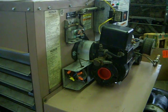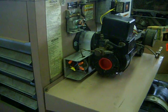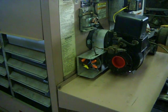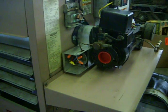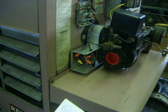Another thing, do not mount your furnace in the center driveway of a shop. Sometimes people back their semi-trailers into the shop, and they back right into the furnace on the ceiling, running, and knock it smack off the ceiling while it's running. It's not pretty. Don't laugh. It has happened. Fasten it on a solid shelf or from the ceiling, somehow where it's safe.